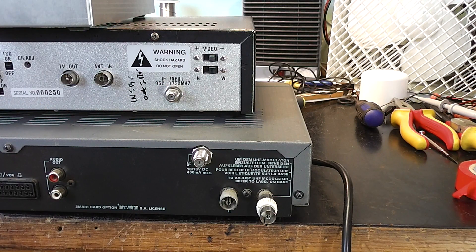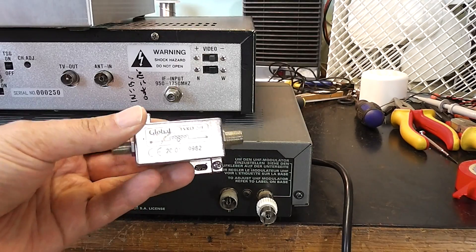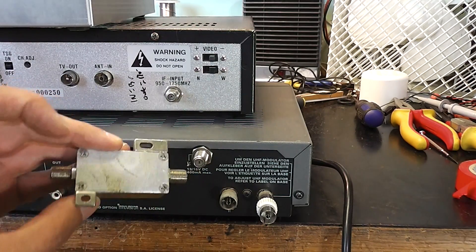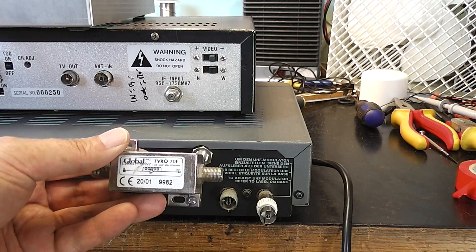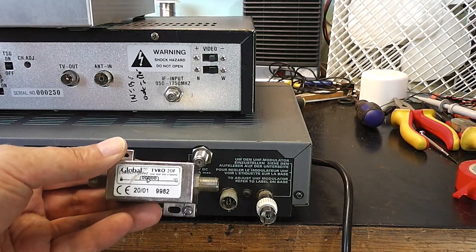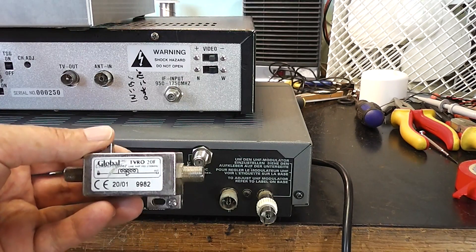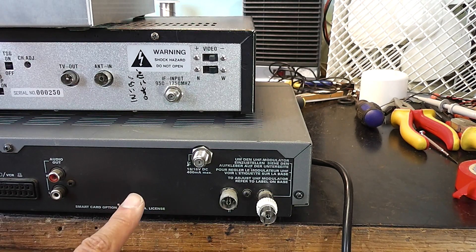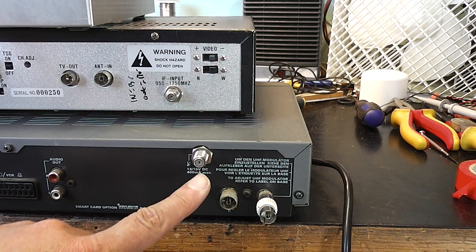Because the LNB is a converter it also contains some gain, so if we're not using it because we're not receiving satellite television, we're going to need to replace that gain. These line amplifiers can be useful — they plug between your aerial and the satellite receiver and provide a certain amount of gain, typically around 20 dB, which helps make up for the gain lost without an LNB. They're a little noisy so not ideal, but there's also power on this socket because the LNB is normally powered up the coaxial cable. Be careful not to short this output power as some satellite receivers will blow up.